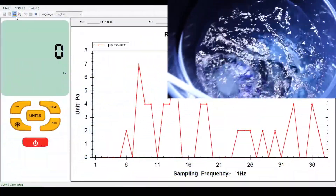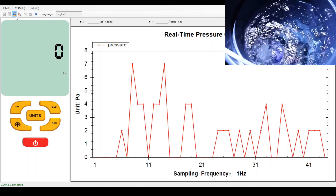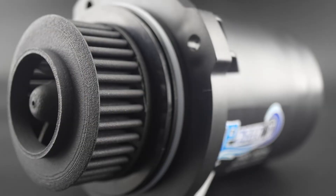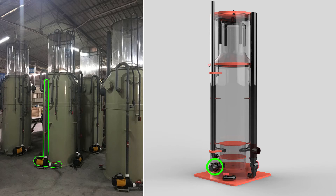As the experiment showed, the needle wheel pump is the most effective way to generate large amounts of fine bubbles; however, it is very sensitive to water pressure when used in commercial skimmers. Therefore, we developed our in-house commercial skimmer needle wheel pump — the Poseidon HVDC 200W — which can generate over 4000 liters per hour air intake under 1.5 meters of water pressure. The pipeless pump connection further improves pump performance and reduces head loss.